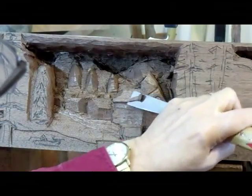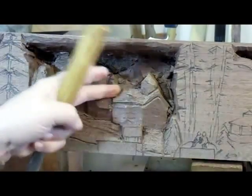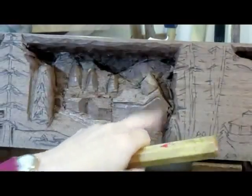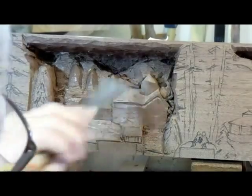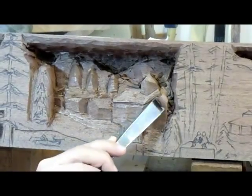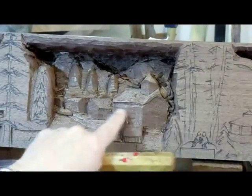So everything is just kind of fine-tuning as I go along. Now with the chisels — the back side of this roof here, you can see it's not real straight. So I just take my chisel and I'm going to follow this curve going up that angle. Still not undercutting — I'm going straight back in. This plane I'm going on is the same as this plane of the front of the building, following the same plane. I am going the same plane as the side of the building, so it's going to be fine.